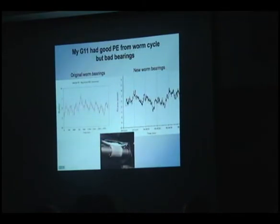And it turns out that here's the worm, right here, the y-axis. This is the worm. And that worm is held by these 2 mirror blocks. There's one here and there's one off the image. And there's a bearing in here. And it turns out that the 76-second error is the amount of time it takes one of the bearings to get from one position to the identical position. Every 76 seconds, those bearings repeat. And they roll once. And so that's what this is.